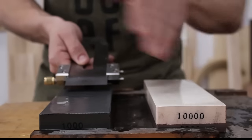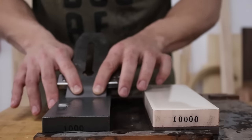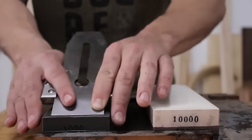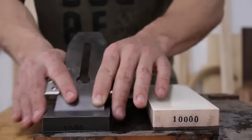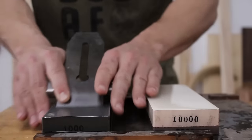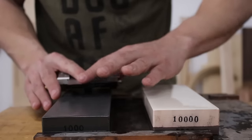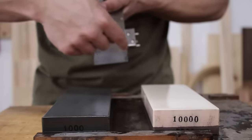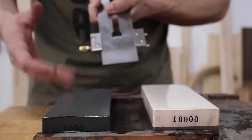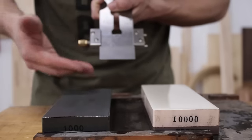Camber is just the British word for round. What I'm going to do, just like before with fingertip pressure, is put more pressure on the left-hand side and take 4 to 8 strokes, then pressure on the right side. I check my burr again — feels beautiful, feels good. All that's doing is putting the slightest of rounds on this blade, maybe three thousandths, five thousandths, or ten thousandths of an inch. It's going to prevent the corners from digging into our material once the blade is set up.